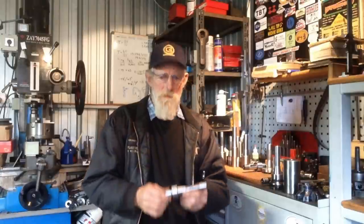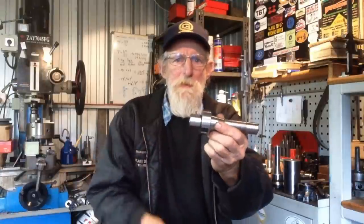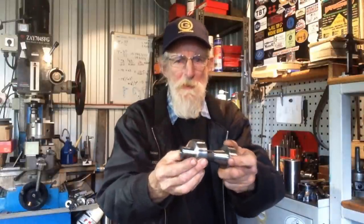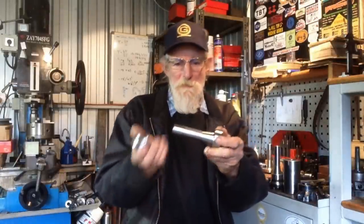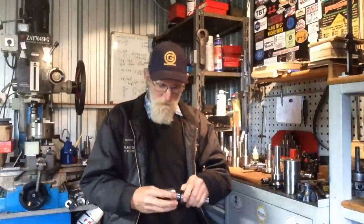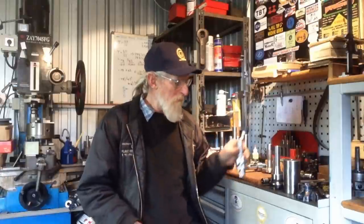So this episode will concentrate mainly on the tapered sections of the R8 tooling and a couple of the parallel sections. And remember, we're going to use this R8 taper gauge that we made some time ago to make sure we nail our tapers absolutely spot on. Now, if we get time, hopefully we'll get into a bit of side wheeling for the flat surfaces and maybe a quick discussion on some of the grinding wheels we've been using, how and why we've been using those wheels. So anyway, we'll head over to the grinder.